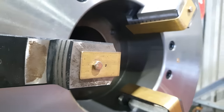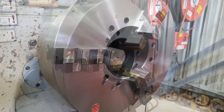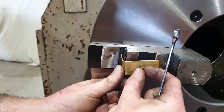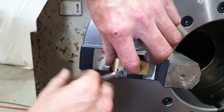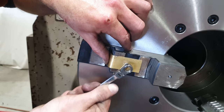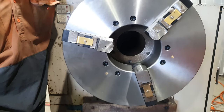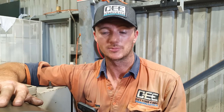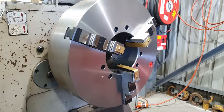That is the jaw set up — here's what it looks like with the internal brass pads installed, and here's what it looks like with the external brass pads installed. This little project took about an hour of my time and just over $20 in material for the brass flat bar and the bolts. If you're able to do something like this, I really recommend it — it saves a lot of time setting up jobs, because otherwise you'll drop a shim and it'll fall into the swarf bin and you'll have to go digging for it. That's how I drilled and tapped my hard jaws to take brass pads — thanks for watching.